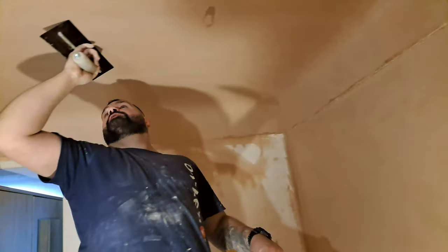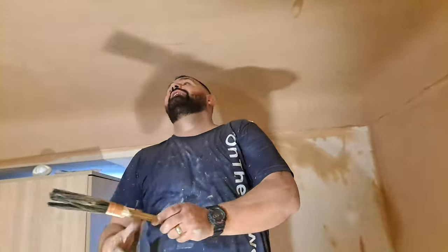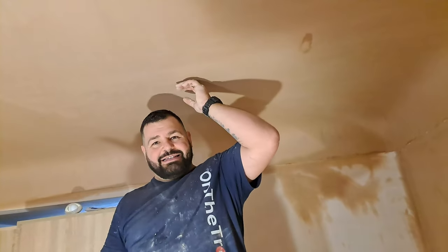Now, it is hanging a little bit in the middle. This is still fairly wet, so I might not get away with just giving it two wet trowels and a polish. It might need another trowel, which is fine. Basically, two coats flat in and two wet trowels and a polish is the minimum that I can get away with doing. That's the minimum to leave a lovely job.